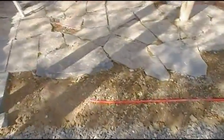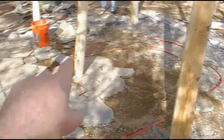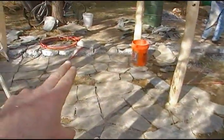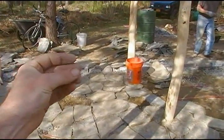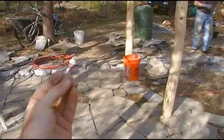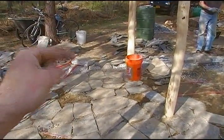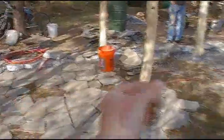You can see the floor is coming along. There's 100 feet of PEX tubing that's in a circuit through here. That'll be attached to the wood stove, which will be right around here on the north wall, attached to a water jacket, and I've got to figure out some thermo-siphoning loops to heat the stones under here with hot water from the stove.